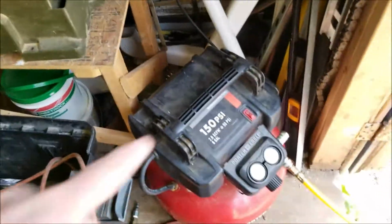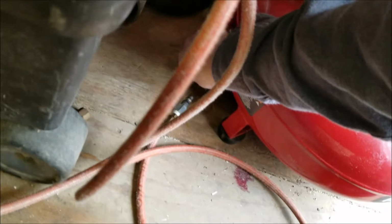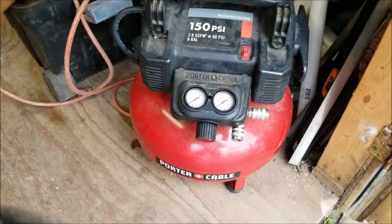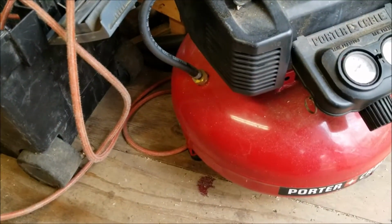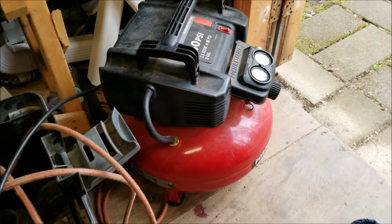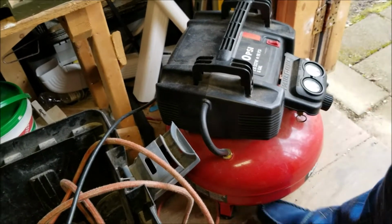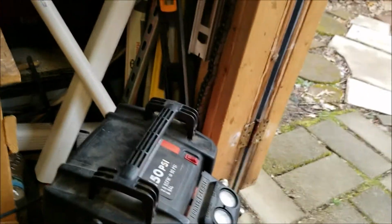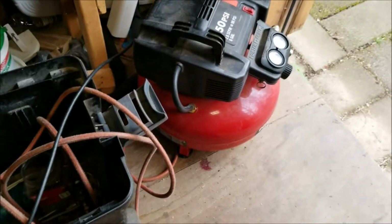Forget, shut your compressor off, and then always drain out the air. See that? It's only hand tight, so if you try to turn it and you're confused about what direction you're going. So yeah, when you compress the air, there's condensation issues or something to that effect, where the moisture from the air accumulates in the bottom. So that's why you gotta let the air out from the bottom. Otherwise, you end up rotting out the bottom of your tank. And there's all nasty water in there too.